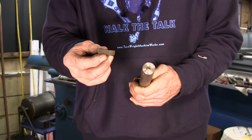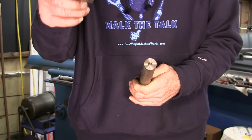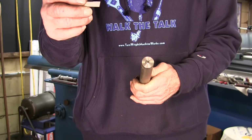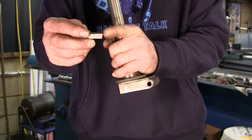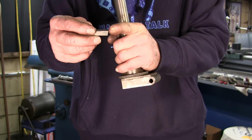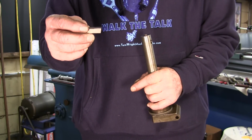And here's our piece of cobalt that we're going to sharpen up. Now, the end of a cobalt bit or high-speed bit, they're usually angled a little bit, so your relief is already built in there. Now, we'll lessen that up slightly right along the leading edge. The least amount of relief on the cutting edge on a shaper holds the edge and makes it stronger.